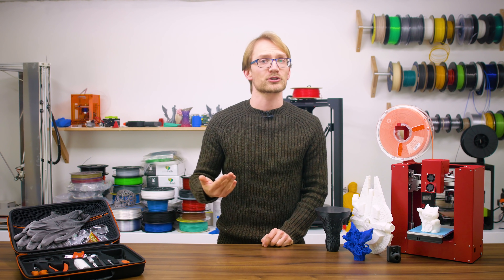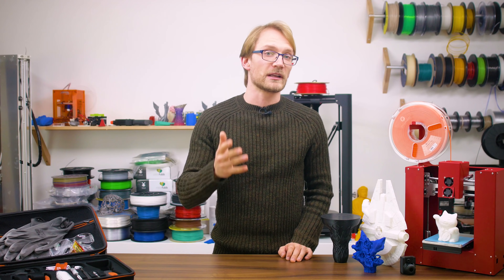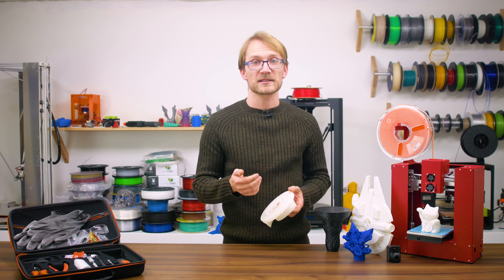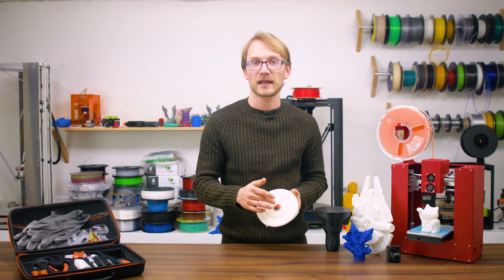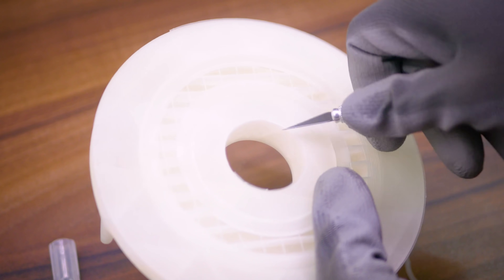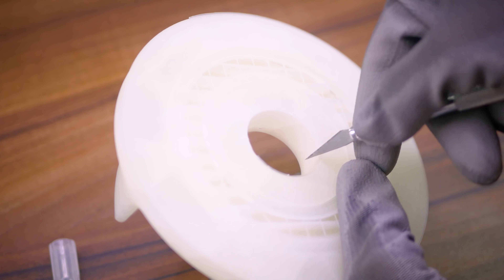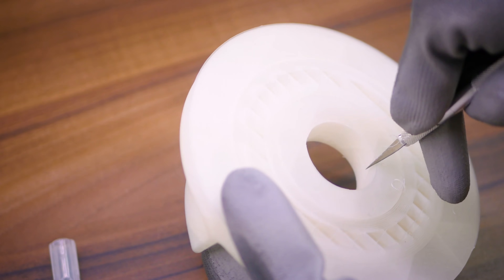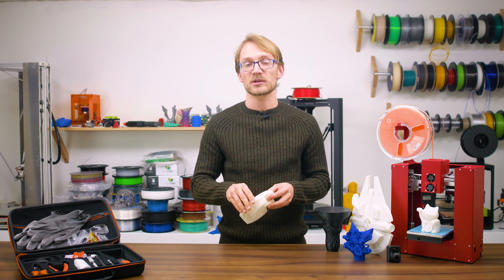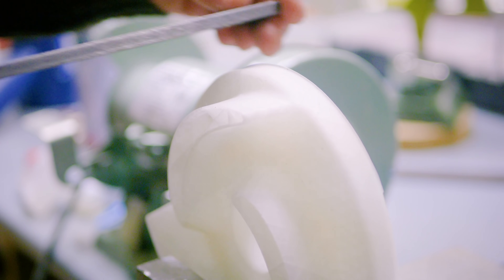This lip can end up quite sharp and, most importantly, keep your parts from fitting well together. Or you might have used the brim feature on purpose. What I've found to work really well with a bit of practice, particularly for concave and inside parts of your print, is just to grab a box cutter and use the back of the blade to guide it around the contour. For convex shapes this doesn't work that well, and while ABS and copolyesters cut really easily, if you're using PLA that is particularly brittle, then cutting just won't work at all.